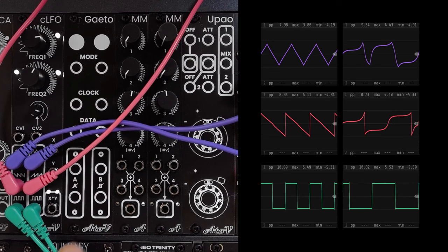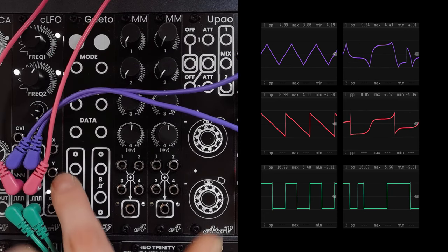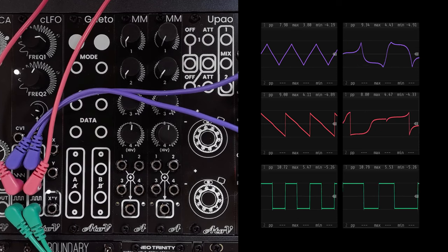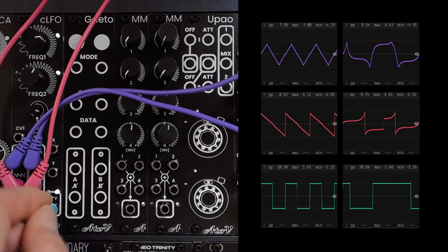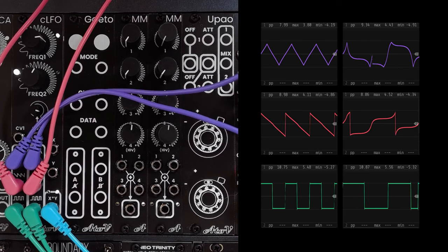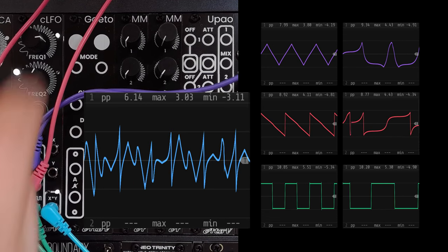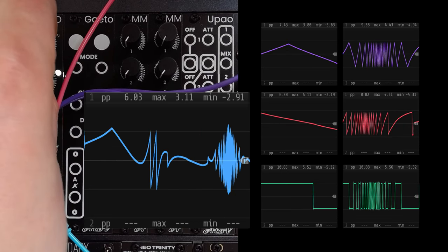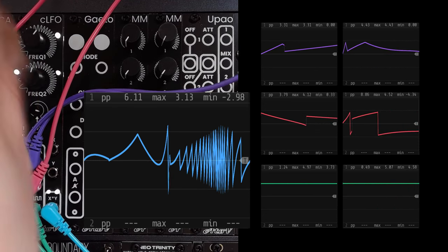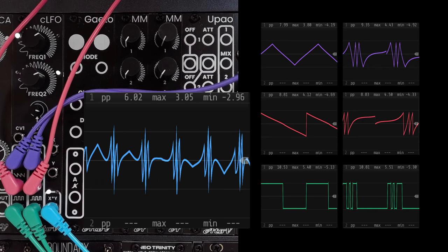However, there is another output right there, and that's the ring modulation. The ring modulation has two inputs, X and Y, and this is the X times Y. So if we then grab a blue cable into the last one, you'll be able to see that as well. If you don't have anything patched in there, it's going to be normaled to the triangle waves. And this is, of course, a very interesting piece of modulation, especially if you go into a bit higher frequencies. It's very compelling, if you ask me, especially if you get them into the same range. It's a very rich modulation that you'll get there.